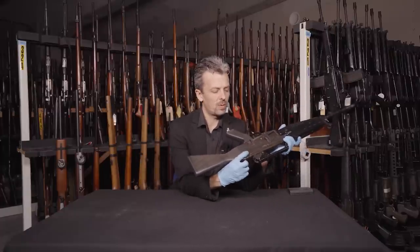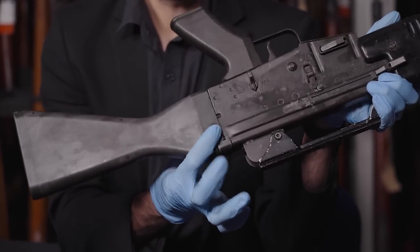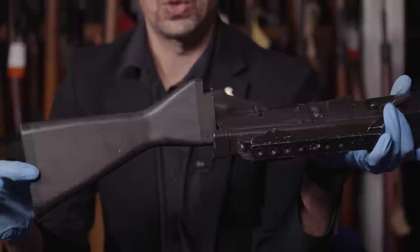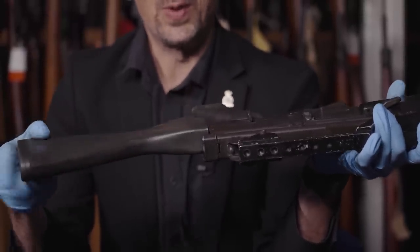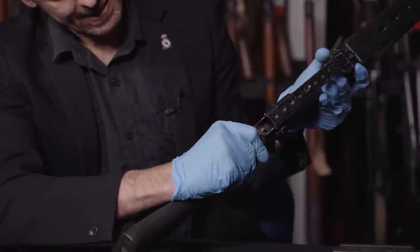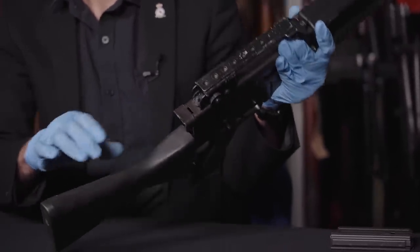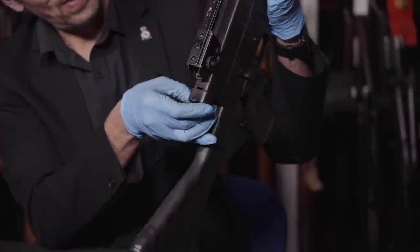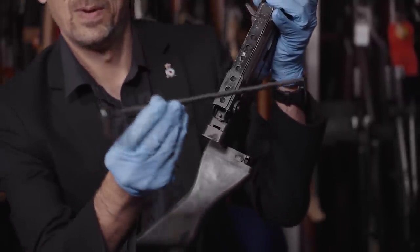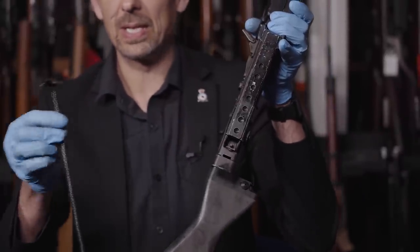We then have this catch — which is a bit reminiscent of the cone hammer on a C96, now that I think about it — just an easy way to grasp it, pressing downwards. Press that and rotate. The butt doesn't come off at all and flaps about and gets in the way, so turning it to this position is probably the best for the initial stage of disassembly. We then press in and down on the recoil spring backplate here, and then we need to give it a bit of a kick with the cocking handle so that it actually comes out. We can then rotate the butt out of the way. There is our recoil spring guide rod and securing plate, which just hooks up and into the receiver to secure it in place — a bit fiddly to put back in.